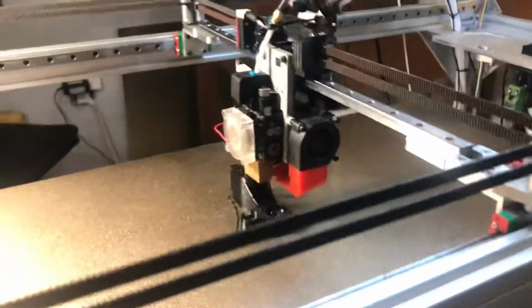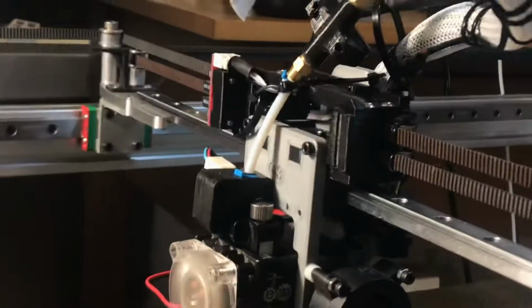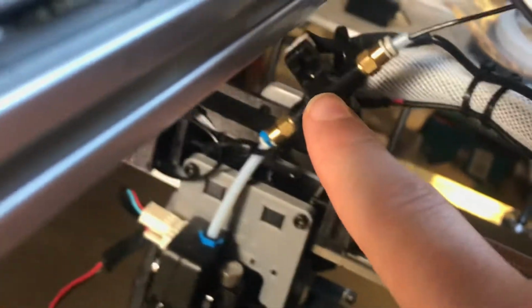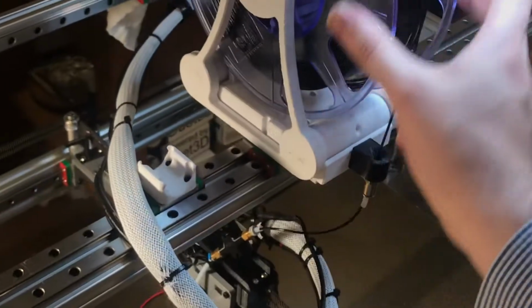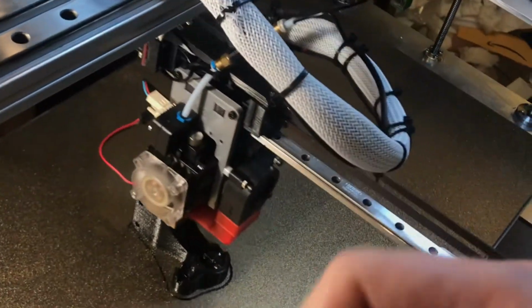I'll show this off. So this unit right now is currently featuring a carriage that, you can see the G3 there, features an optical runout sensor, but also, for backup auxiliary, a runout and stall or jam detection magnetic sensor, filament sensor featured here. But this runs in tandem with it, so that if a stall or anything is detected, or rather if there's filament runout, this filament system keeps the filament right above where it needs to be throughout the whole print. It carries it along with it to have a short route through the path all the way to the nozzle.